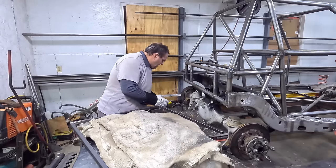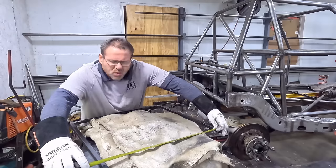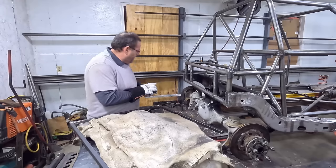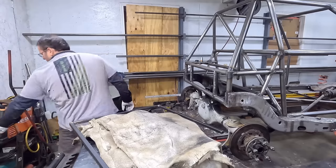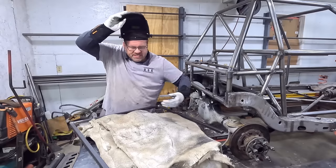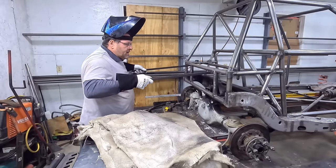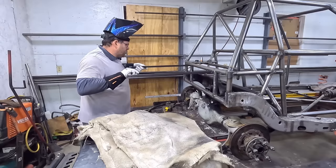Make one more check to make sure this thing is still square. I did this at 24 and an eighth — it's 24 inches — so I want just a little room to be able to slide the tank down in there, so it's 24 and an eighth inches what it is. And it's 25 inches this way to fit this fuel cell while leaving room for the flange on the front. I have to kind of wing it until I get it spotted and then we can start checking it with levels — make a few guesses, put a few spots, and then go.